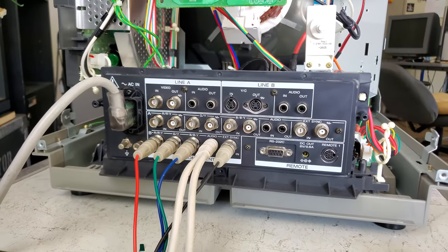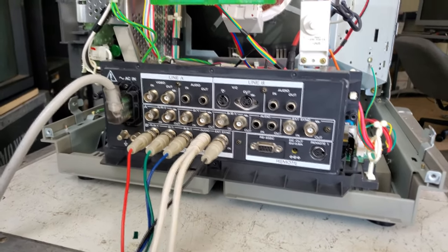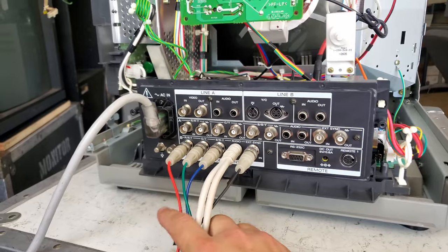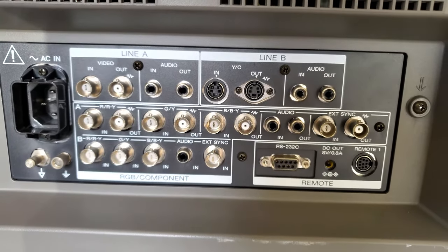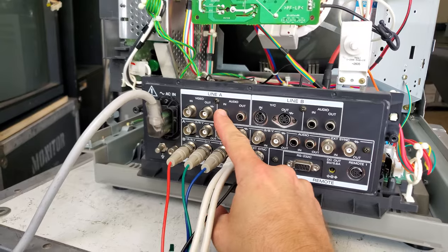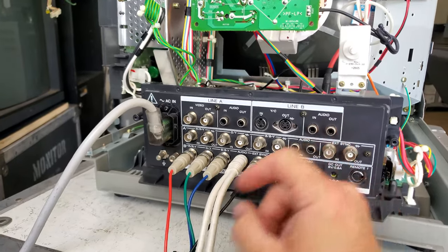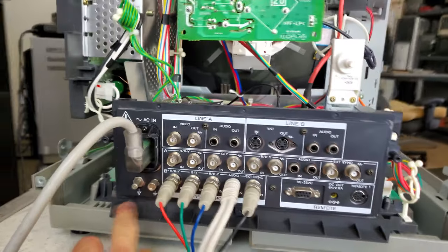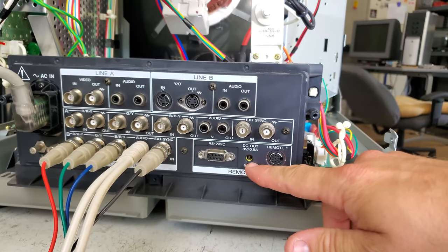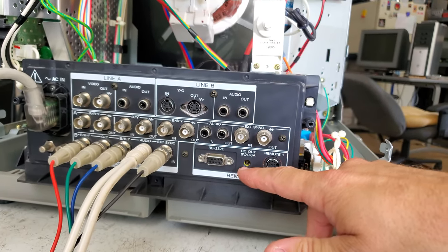The input board is the reason the M2 MDU series is the most desirable of all the M2s. You get a second input at the bottom that can be switched between RGB and sync with mono audio, or switched over to component input. You also have support for a single composite and a single S-video in and out with mono audio. There is grounding in and out — a feature for medical units only — plus connections for controllers, and a DC 8V 0.8A output available on this input board.